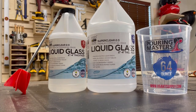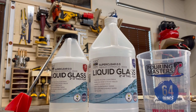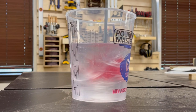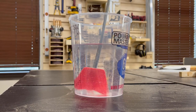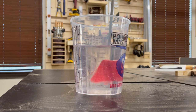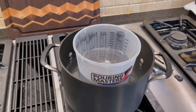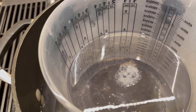To create the clear mixture, we'll use the same method — two parts resin to one part hardener — although this time we won't be adding any pigment. It's interesting that the mixture starts out cloudy, but once you've got good mixing between the hardener and resin, it turns into an almost completely clear fluid. With this clear fluid, you can see a lot of the air bubbles being introduced as we mix it. I tried my best to avoid it, but some is inevitable, so I go back to the hot water method to mobilize those loose bubbles.